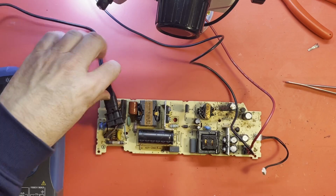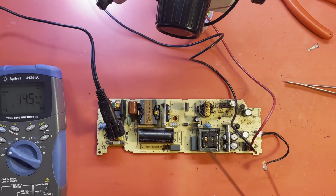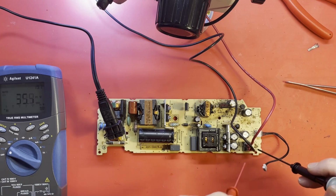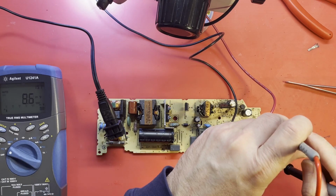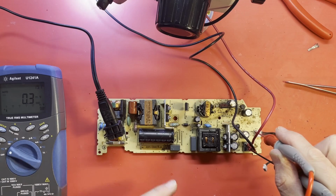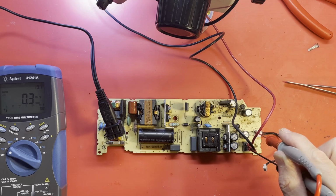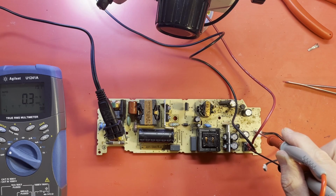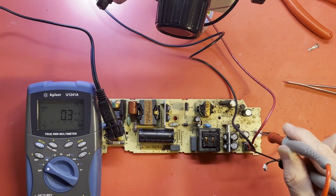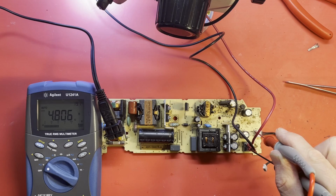It's not on right now. Let's see. My meter set up. I think we're ready to apply power to this again, and hopefully have a slightly less amount of fireworks. All right. What am I forgetting? Okay. AC power on. It's turned all the way to 0 right now. So I'm going to bring it up slowly. There we go. 4.8. Okay.